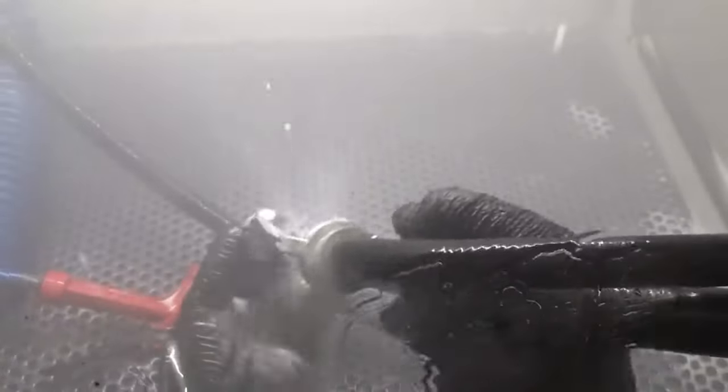One of the other benefits of wet soda blasting is that it's a fantastic cleaning process — very quick and very easy. In a wet cabinet, you have to supersaturate the water, because the abrasive is going to break down and absorb into the water. So you add almost double the amount of media into a cabinet to actually have some grit left over. For example, if a smaller cabinet normally uses 25 pounds of abrasive, you'd put 40 to 45 pounds of soda in. That's going to last a couple of days, and then you'll need to start adding about five pounds every couple of days as it breaks down.